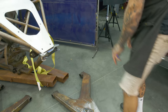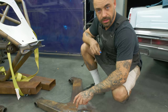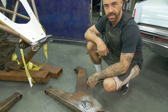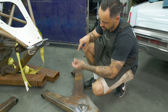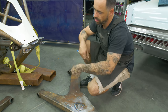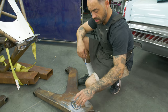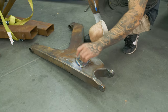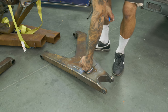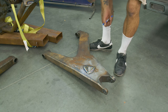These big lower arms on large center-mount kit cars make it hard to find a jacking point. Some people just cut a short piece of tube and weld it on so the jack isn't slipping. We added proper jack points — chromoly eighth-inch plate, welded on in a nice little triangulated version — so you have a solid point on the bottom side of the arm to jack it up without any bad news.